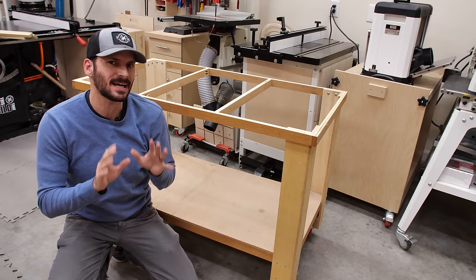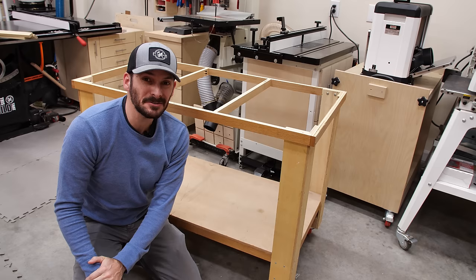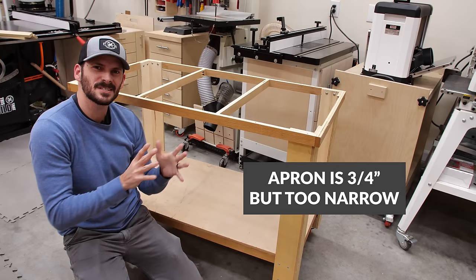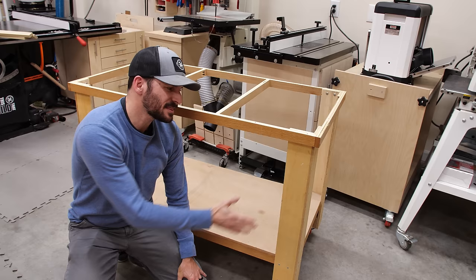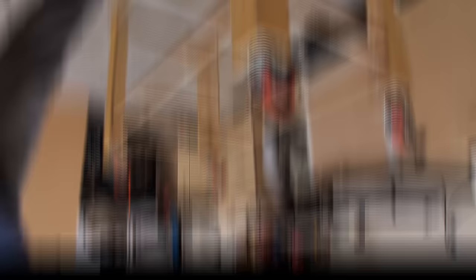I'm getting the top off and I'm actually going to salvage the wheels off the old outfeed table. I wanted to show something I get asked a lot: is it okay to build with less than three quarter inch material? These legs are half inch plywood and I had this table for about 10 years — the legs have held up great, it was just the top that had flex. Half inch for the legs is perfectly fine and can take a lot of weight, but it's better for vertical members. I wouldn't do half inch for horizontal members — make those sturdy. I flipped the old one over, removed the three inch casters, and disassembled the rest of the table.